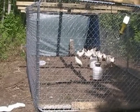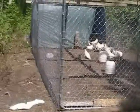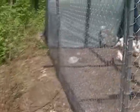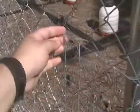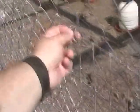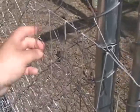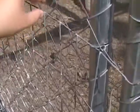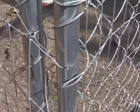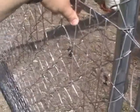Now that does a real good job of keeping your large dogs and so forth out, but you have to supplement more than that in a natural environment. As you can see here, we went back on the outside and put a welded wire weave on the outside of the chain link. We use steel wire, very inexpensive, to fasten it down. Then on the inside, we use poultry netting chicken wire. This will stop large creatures from going through, medium sized varmints from working their way through, and most small predators from getting through the chicken wire.